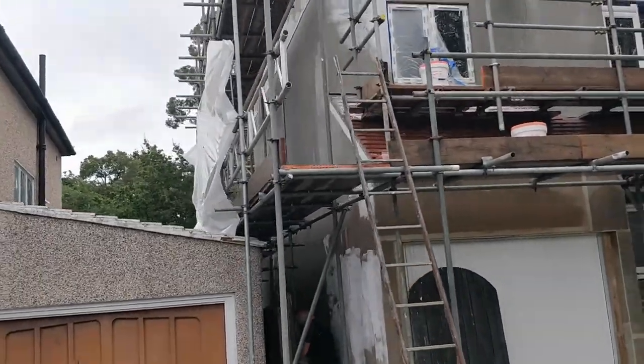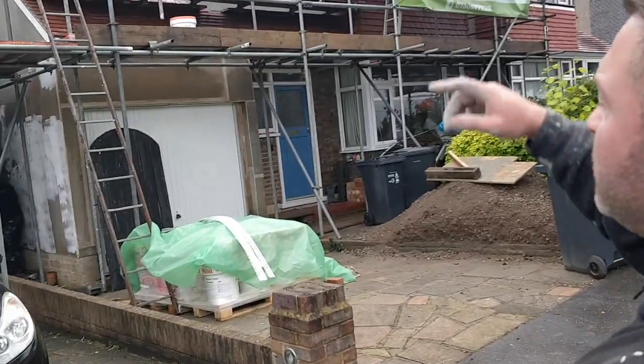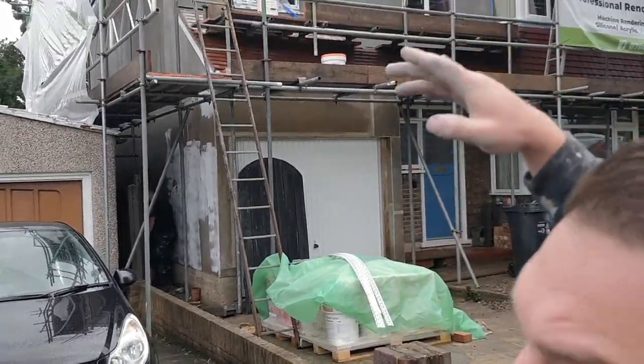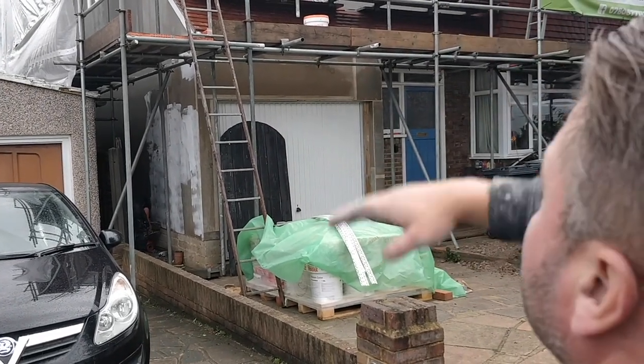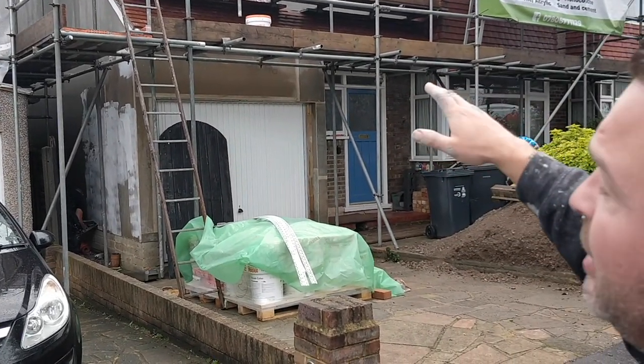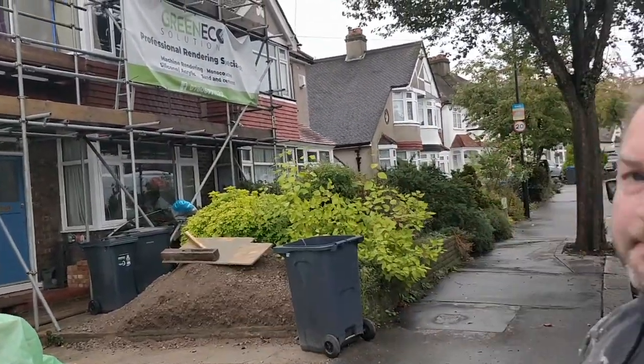Right, so you've almost finished doing a full coat on this side. And what were you saying about the way that you go about it? To go up and down, to get out all the hollows. Yep. So if the walls are shaped that way, we tend to go up and down, we'll bring it all the way down. When that dries out, we'll come across the other way, start leveling it off the other way. So you almost get a kind of lamination, one bit going that way, one bit going that way.